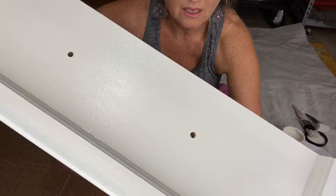Chalk mineral paint is typically more of an artistic paint — people want to get in there and blend colors, do drips, you know, very artistic. But some people are doing a super clean farmhouse finish, so rollers work great with that too. Just brush it on in the amount you want, then roll your brush strokes out if they're bothering you. That's it, you guys — I hope you learned a lot tonight and I hope you'll give Silk paint a try.